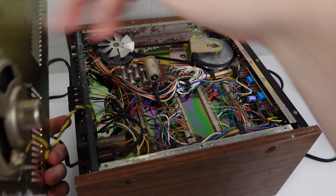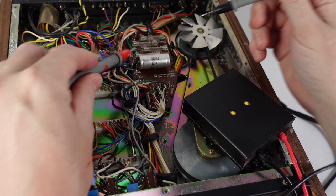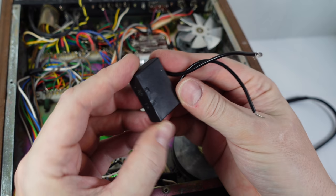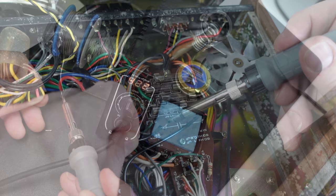Fortunately, after having this thing open before, I now know how to get to the cap. It's just under this bottom cover and I need to cut that plastic coating off to get to the legs. I want to put my discharge tool on here for capacitors - if there's any charge left, the lights on that box will light up and then gradually dim as it discharges - but there's no charge in it at all. Now here's the cap that Sparky Projects recommended, and that's the one I decided to use. It's got these long wires and I was wondering about cutting those off, but I can run them over to the left section and run the wires up to the legs.